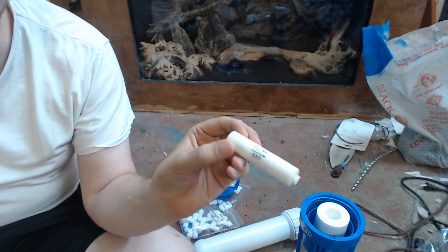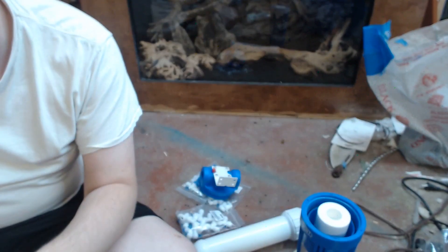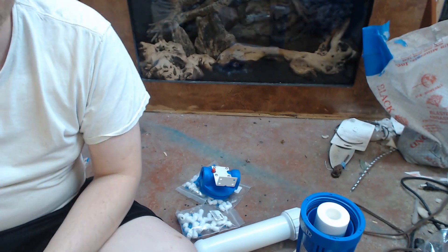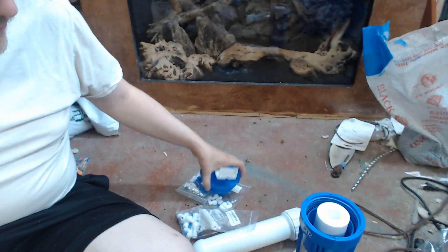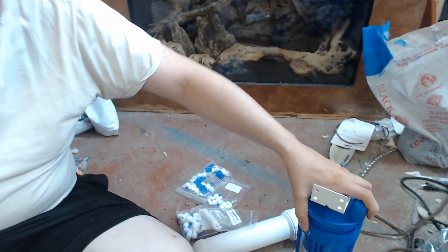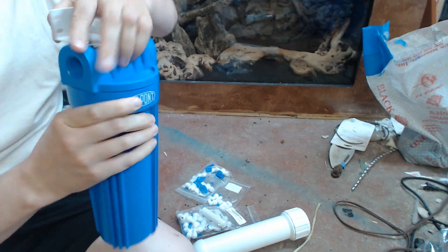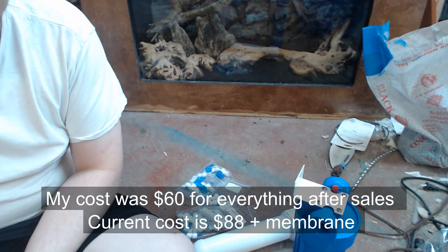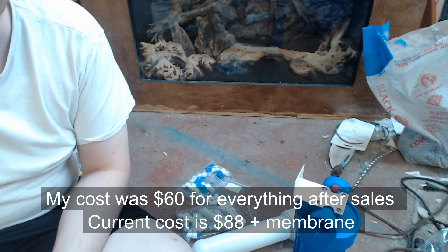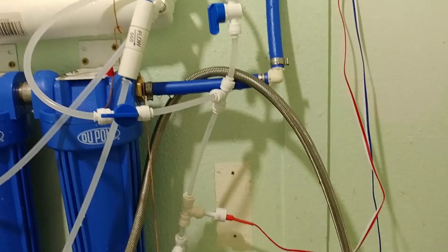The last thing you're going to need is a flow reducer, and the flow reducer is important because if there's not some back pressure on your osmosis membrane it's not going to work. I'm going to go ahead and show you how I've got all this hooked together, just to give you a good idea of what you can do on your own — you can see how you can make your own very cheap, very easy filtration system for between $50 and $70.